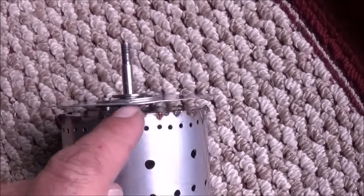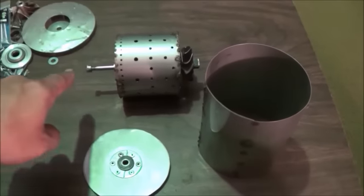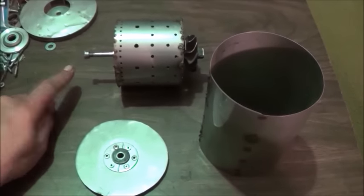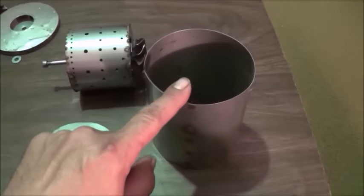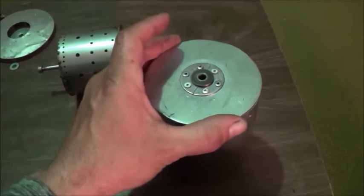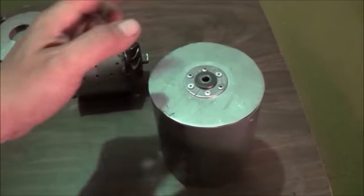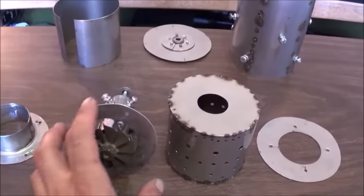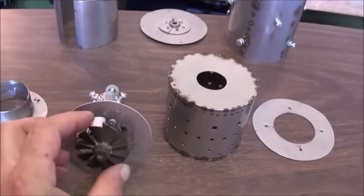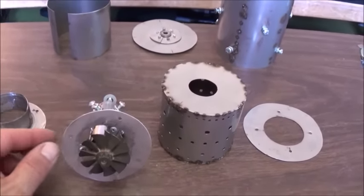I just want to show you the air gap between the face plate and the actual burn chamber. Now that we've mounted the drive shaft with all the bushings into our burn chamber, I need a way to stick that drive shaft in to hold the compressor fan out of the front of our case. This is the outer case of the engine. This face plate gets welded onto that case, so our compressor fan will sit out here with the diffusers and holes. We're trying to mount our rotor to the burn chamber, which will then be mounted to the outer case. I needed a mounting point from the inner rotor holder to the outer case itself for the burn chamber.